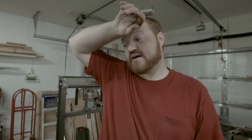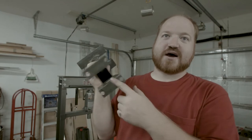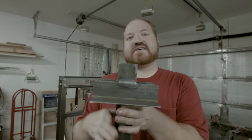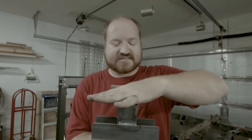It's been about 24 hours since that last bit of epic fail. A little bit of research, and from what the internet says I need to make a fixture to be able to hold the hub of the wheel and press on the shaft. So I made this little guy — I had some angle iron from another project so I turned part of it into some box tubing, with a flange on the bottom that bolts to all four bolts of the hub. This sits in the cradle of the press, the shaft sticks out, you press down, and the internet says it should pop out.